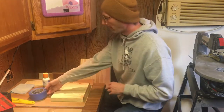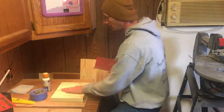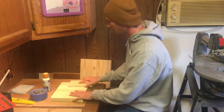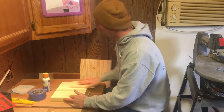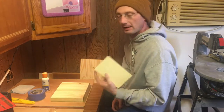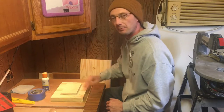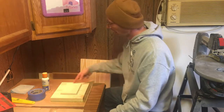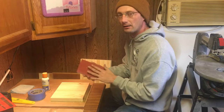So what we're doing here is we're going to prepare a piece of wood — this will be our front surface. I always want to sand this off because there are little burrs and little fibers on here that I don't want to have under my tape, because it could affect how I cut. So I just get this sandpaper and sand it down, keeping it with the grain of the wood. I could have bought one of these sanding blocks at Lowe's or Home Depot, but I had a project a couple weeks ago where I made the measurements wrong on the back. So I just got some spray adhesive, put a piece of sandpaper down, sprayed it, clamped it, and once it dried I cut the extra sandpaper off with a razor blade. I like doing this because I know it's not going to slide off and I get a wide, even sanding area.